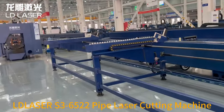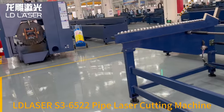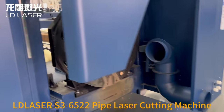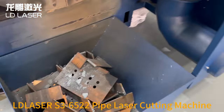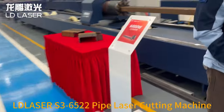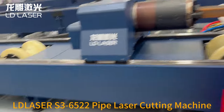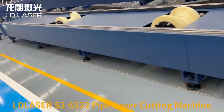And here is our economy model with 2 chucks. We also use a roller cylinder supporter for supporting the pipes. And here are some sample parts made by our machines. We cut some channels. The length can be 1.5 to 6 meters. Also, we have chucks in different sizes. More details we can talk about later.